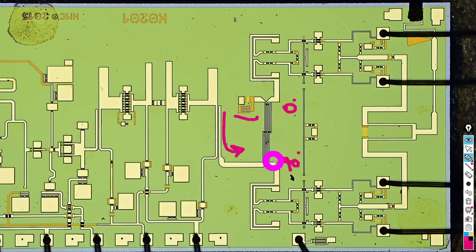You also need the amplitude to be very well matched for good image rejection. But this doesn't solve the problem completely, because the signals going each way are still single-ended and the mixer is balanced — you need a differential signal. So we have a balun here: a single-ended to differential converter. The signal comes in, couples partially in one direction and partially in the other at 180 degrees out of phase. So you get zero degrees on one output and 180 degrees on the other, giving you zero, 180, 90, and 270 — the four phases required to do a balanced down conversion.